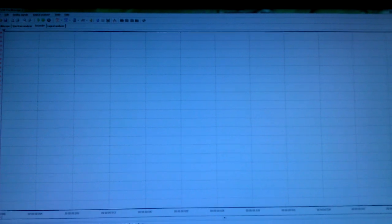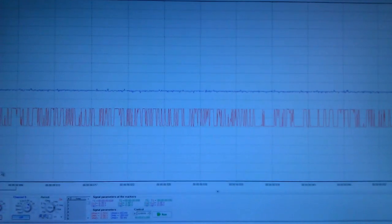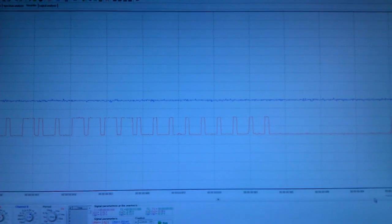is on my computer. You see the screen here. So you see the screen here is actually the scope, the screen of the scope. We'll turn it to recorder mode and then make sure the probe 1 is on, right? And then send a test signal and see how it looks. Okay, see a little bit of jerk up. Let me try that again. Okay, there we go. That signal looks a lot better.